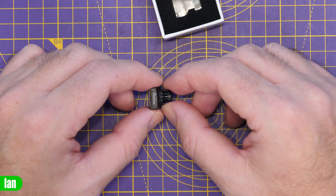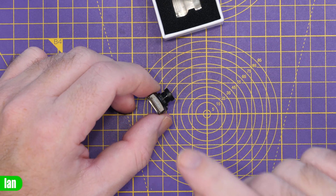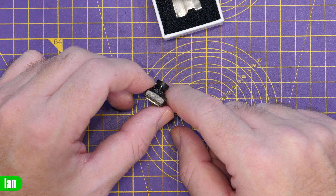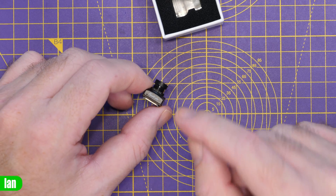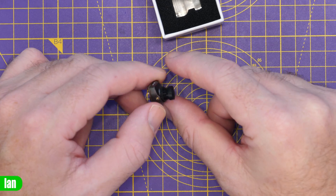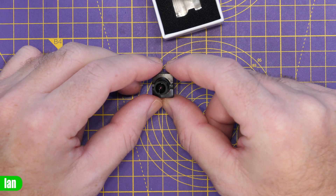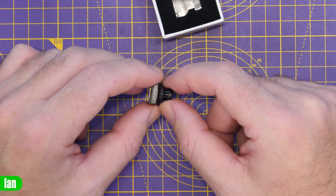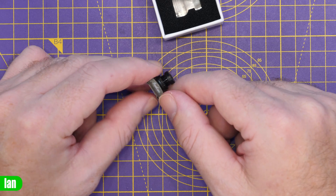There is also a full native 16 by 9 mode, but you will get vignetting on that mode simply as a result of the wide field of view. This camera has an increased field of view over the version 2 — 94 degrees compared to 89 — and it has new sharper optics as well as a reduced weight. HD Zero say it is half as heavy as the previous versions.